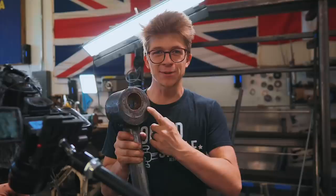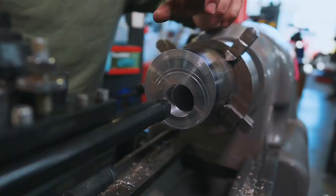We're starting right where we left off. Will is working on making a new pitman. That's right, I've got this piece of 4-inch round chucked up in the 4-jaw chuck, drilling, not my first off-centered hole in the lathe, but it is my first intentional off-centered hole in the lathe, and we're using a boring bar to get this out wide enough to fit in a bronze sleeve bearing.